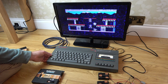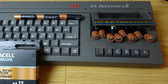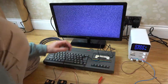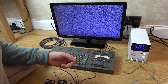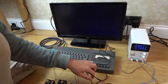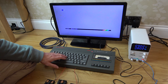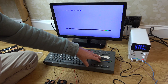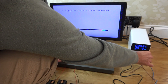Now let's reset and switch to the bench power supply. The reason for using the bench PSU is to save unnecessarily wasting batteries — it will mimic the batteries wearing down as I lower the voltage, and it will also let us know at what voltage things stop working or glitches start happening. Set to 9 volts, touching the leads together it shows 2.1 amps, mimicking the proper Sinclair power supply. I need to remember it's center pin negative.